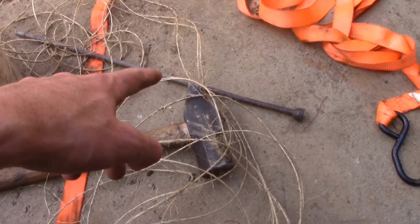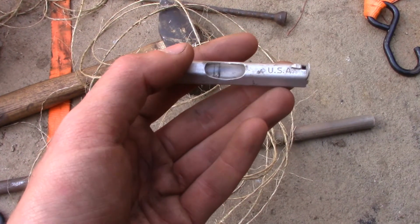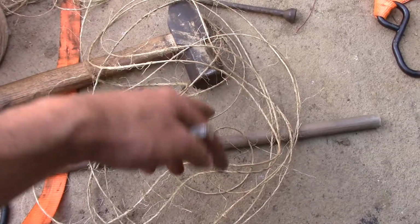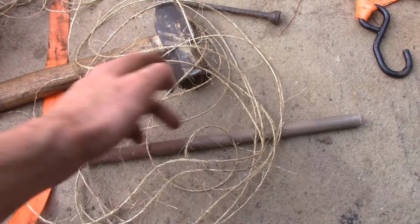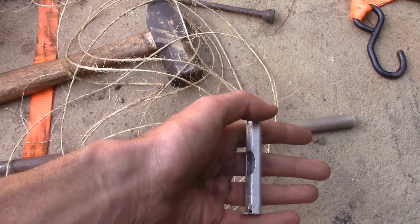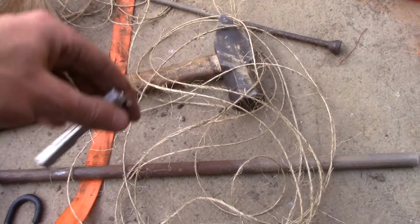Very simply, I just took some steel rods, hammered them in the ground, pulled the string nice and tight between them, used the string level, got the string level by adjusting it up and down on the rods, then used a tape measure to measure the distance from the string down to the gravel pad on one end of the run and then on the other end. And depending on the length of the run, you want to make sure you have a proper amount of slope, amount of pitch. And it turns out to be about 2.5 inches for every 10 feet.